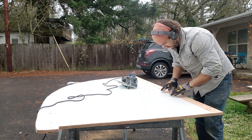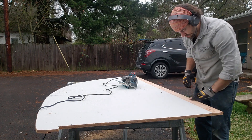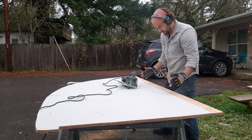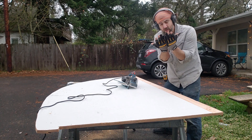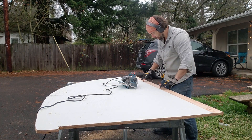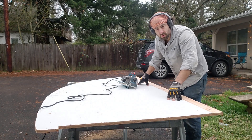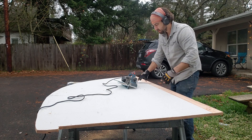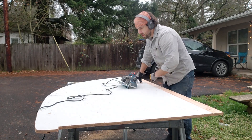This will replace that, and what I'm doing here is I'm creating a recess along the edge so that where they butt together, we can put a strip of 6-inch fiberglass or two over the top of them to make them super duper strong, taking epoxy down that seam as well. So, hopefully this fits — we'll go up and test fit it here in just a little bit.